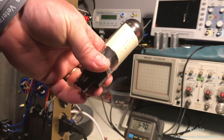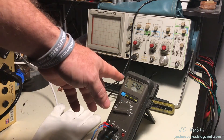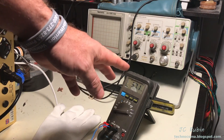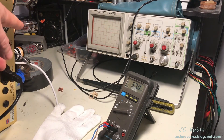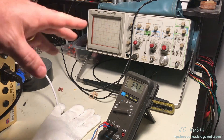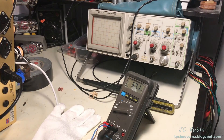I've let it sit for a little while. I've set the bias back at 37.0 milliamps and since the currents are not drifting too much anymore, what I'm going to do is go through all four of the tubes, switch this meter, and just make sure they are in fact matched. I'm going to shut it down, move to the next one, turn it back up and see that everything is okay.